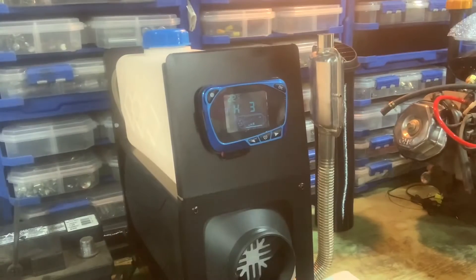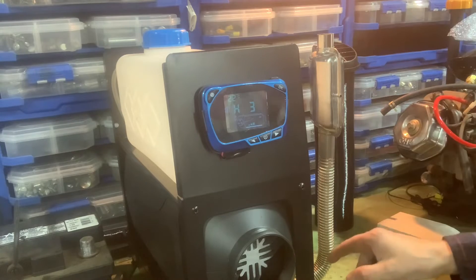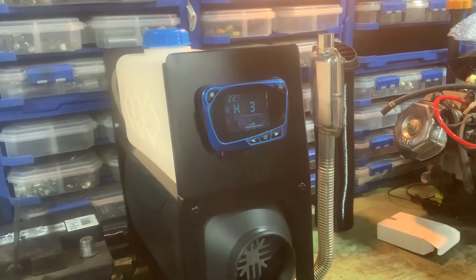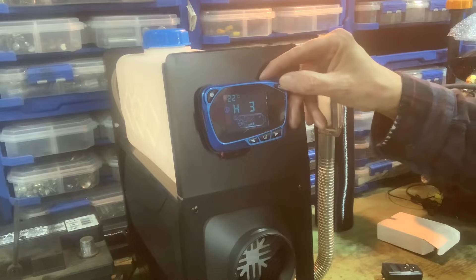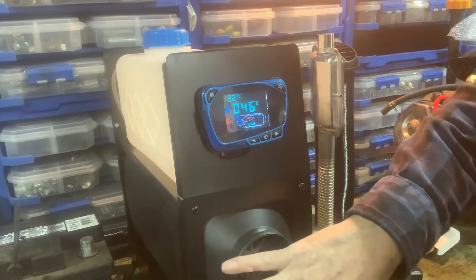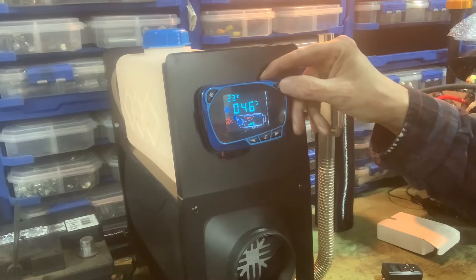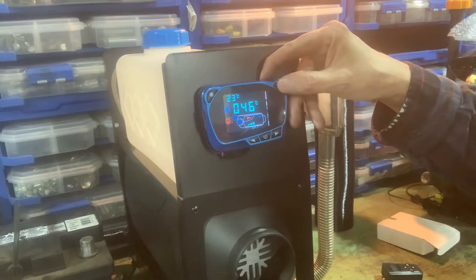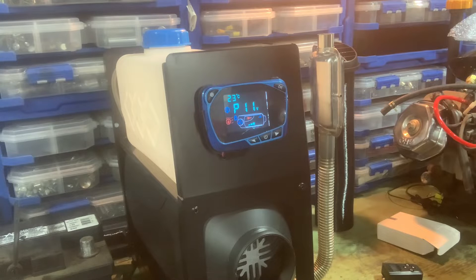You can see better without the glare. We'll probably see some steam coming out — I shut it off last time and it cooled down, and it gets condensate in there. You're supposed to leave these exhausts pointing downward so any condensate will run out. I've got it on heat setting three, which is medium — there are five or six settings. Hitting the OK button shows the internal temperature — it was already at 46°C because I had it on earlier. Room temperature in the garage is 22°C. The glow plug is glowing and there goes the pump.